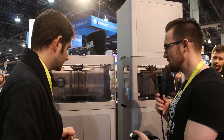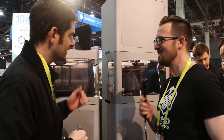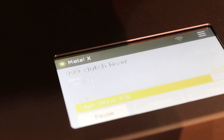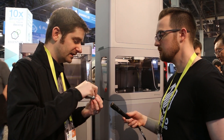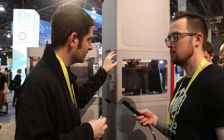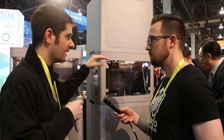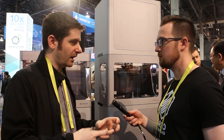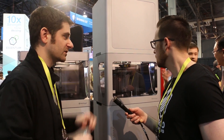And this one is very different from the Mark X — this is our new Metal X, debuting at this show. It uses a similar idea to our composite technology. On the composite, you have continuous strands of fiber encased in plastic. Here, we have metal powder encased in plastic that you melt layer by layer to build your part. When the part is fully built, you put it in an oven, burn off the plastic, and the metal diffusion bonds together. We call it Atomic Diffusion Additive Manufacturing, which describes how the little spheres sinter together.